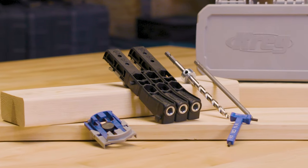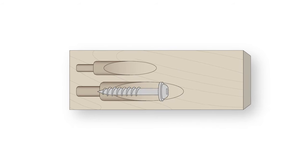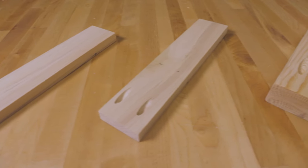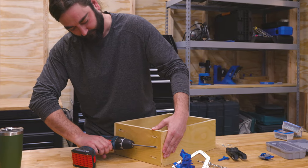Like our other micro drill guides and accessories, the Kreg Pocket Hole Jig Micro creates a 33% smaller pocket hole. These smaller pocket holes are perfect for working with thin and narrow pieces, three-quarter inch and smaller. Another key advantage for micro pocket holes is the opportunity to use smaller head screws for easy concealment using our micro plugs.